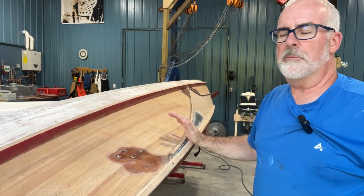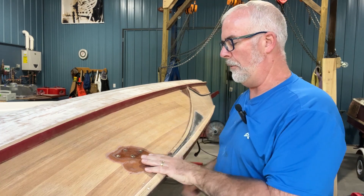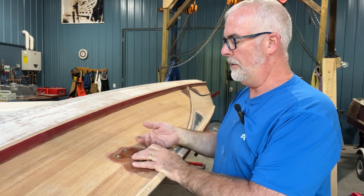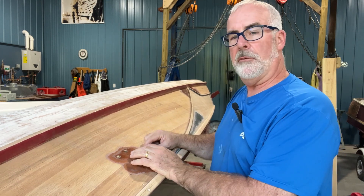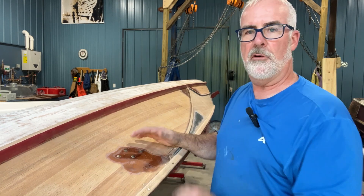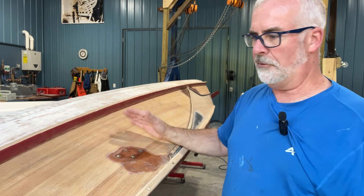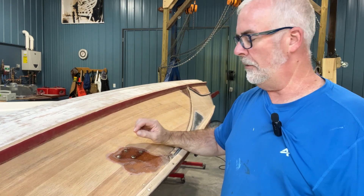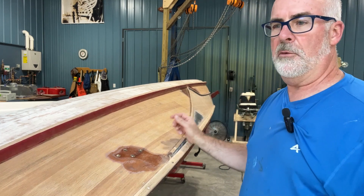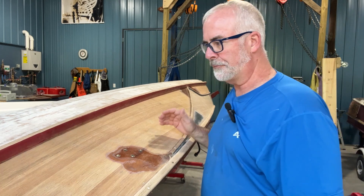The sanding is done on the boat. In order to finish the bright spots and color areas well, I'm going to release the steering block for the steering gear — I'll take the nuts off the back side, pop these out to give me a flat surface to work with, and when I put it back after varnish and stain I'll reseal them with 4200 by 3M. I have the same issue down on the stern where the pulleys for the stern area are located that run to the motor, so I'll take those out as well and finish this topside sanding.